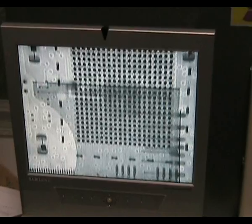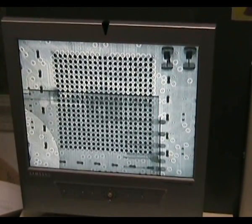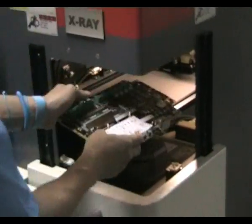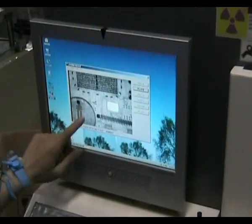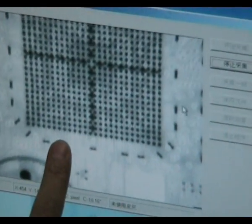It's a really neat system. We didn't actually find any fault with the BGA on the X-ray machine, but it turned out that when you applied physical pressure to the BGA, it did actually have a dry joint. So these X-ray systems are not infallible, but they're a really neat tool, and most good assembly houses will have one. I hope you enjoyed that short tour of a typical PCB assembly factory in China.